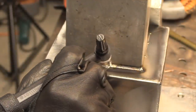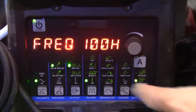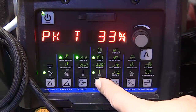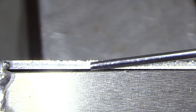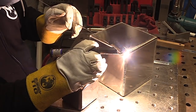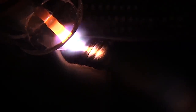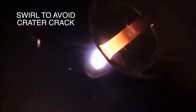The clear cup also shields really well, giving you some really good shielding on your bead. I hardly ever leave the wire in the puddle on aluminum, but here's one instance where I found it works pretty good. I use 180 amps peak, one and a half pulses per second, 33 percent peak, 33 percent background. You need more amperage when you pulse because you get an average of the low and high. I'm leaving that big 1/8 rod in there because I had a little gap on this outside corner joint. Then here's a clip of the same joint with no gap, just dabbing a 3/32 filler wire.